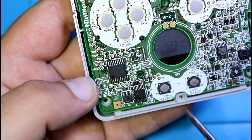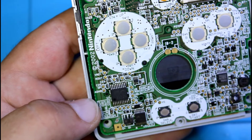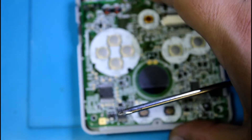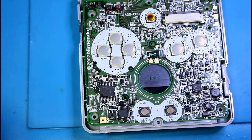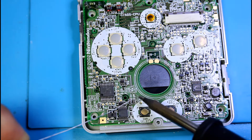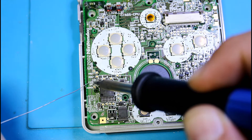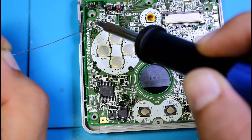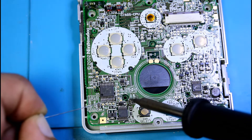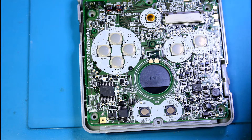The easiest way to do this first is to add solder to these points. It'll be easier to just heat up the pads on the flex PCB and everything will just go into place. Start with the VCC first — just add the solder to it so it's just a little ball there. SP next. Volume last. You can add some solder here already if you want; we're going to be tacking that next.